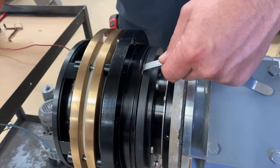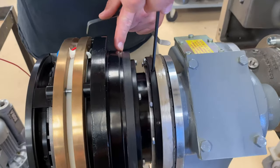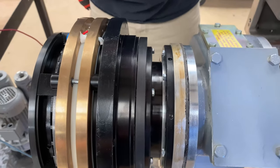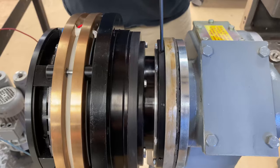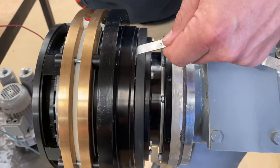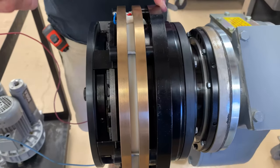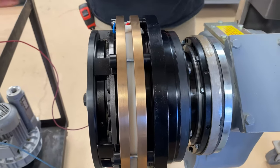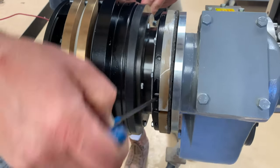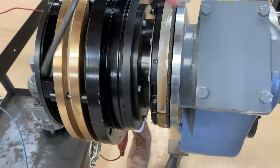Check the gap — that's still a little loose, so we can go a bit more. Power off. That's a little tight, so we need to open that gap up just a little bit. Power off, check it — that's perfect right there. So now we know our brake is in the proper place. We can give this a spin and tighten up the brake. The brake is officially adjusted.